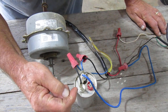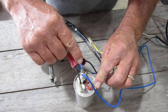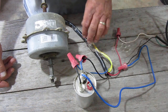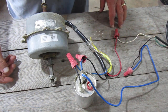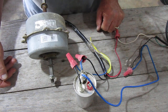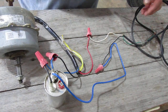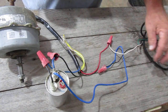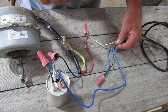You've got a fan on this side here — it's already discharged. You've got common over here on the blue wire and herm over here where the red is. I've taken all the other wires and just taped them off to the side — there's no power on right now. I put some electrical connectors on there to tie those other ones together, but I only use the red wire, the blue wire, and the black wire. The black wire is feeding in from this plug — a little computer plug coming in on the extension cable end.